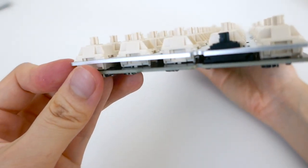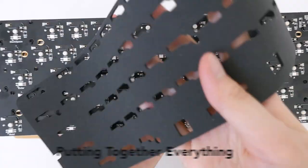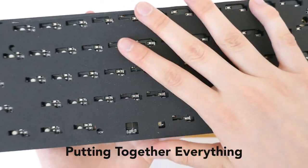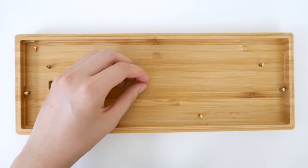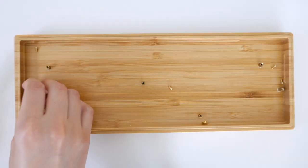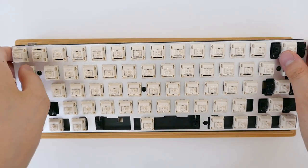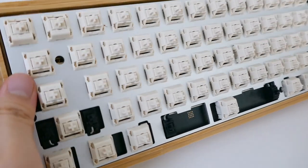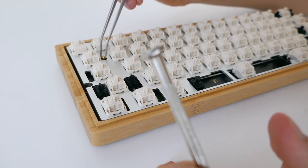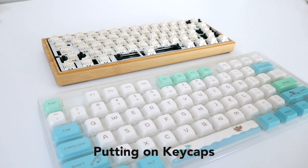Ta-da, we are almost finished! Make sure everything is lined up so it's all even and parallel. I took the PCB foam — it dampens the sound and makes for a nicer keyboard press. I took my case, removed all the screws it came with, took my keyboard sandwich and put it in. Make sure to line up the USB-C port at the end so you can plug it into your computer. The screws are so tiny my fat fingers couldn't fit.